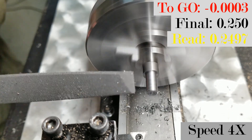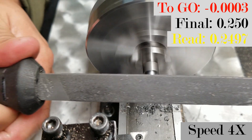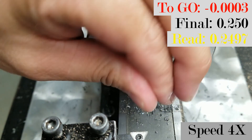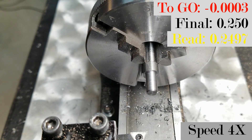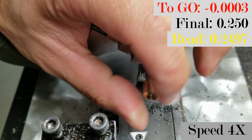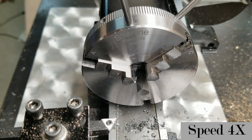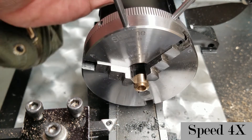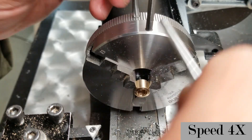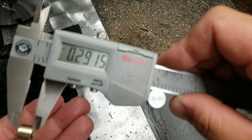I'll get off any chips and let it cool down — it's a little warm but I don't think too hard. Not bad — pretty tight fit, I'm not feeling a lot of play. There's quite a bit of a burr on the end from that rear cutoff wheel. The rear cutoff tool left a pretty sizable burr, but I found a nifty little deburring tool at my local home improvement store — the one with the blue logo — that works pretty well. I took it and nipped it right off.